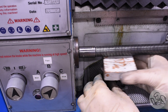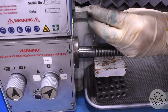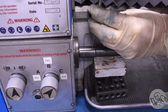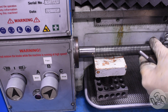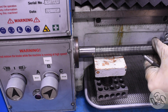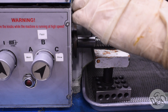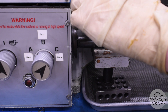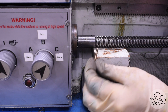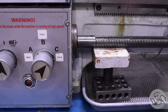I'm going to knock that brass pin out because that'll be easiest, so I'll tappy tap tap that out of there. It's not moving — feels like I'm hitting solid steel, so clearly that's the wrong end to be tapping on. I thought this pin would be straight because it's brass, but it might actually be a taper pin. I'll flip that around and tappy tap tap the other side, and out it comes. And look at that — it is in fact tapered. I didn't know tapered pins came in brass, but there you go. I figured being a shear pin it would be straight, but live and learn.